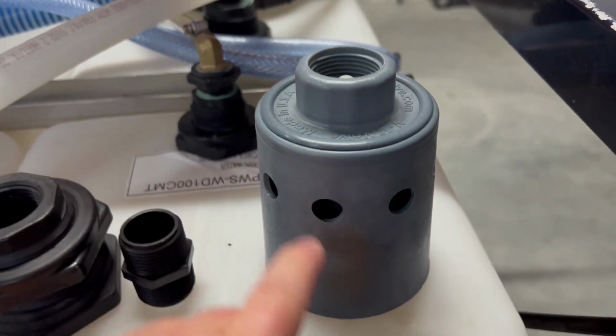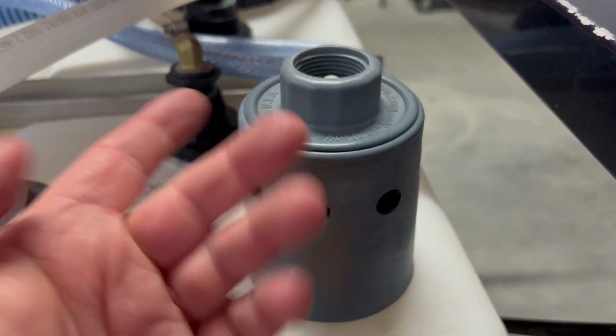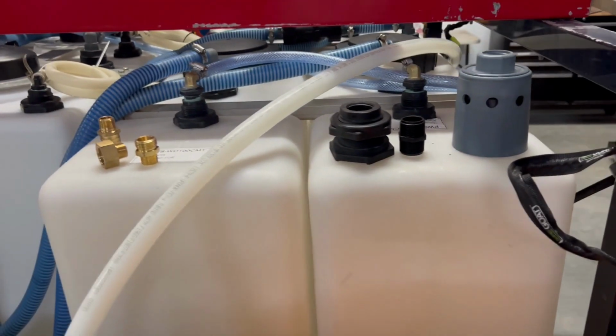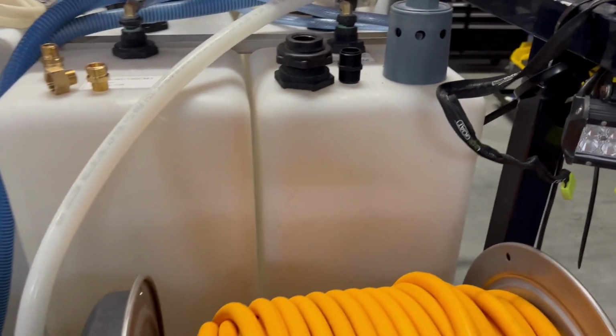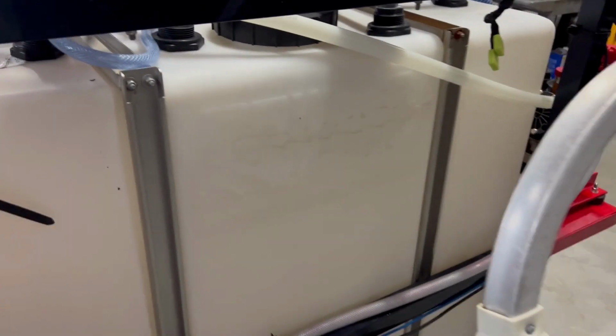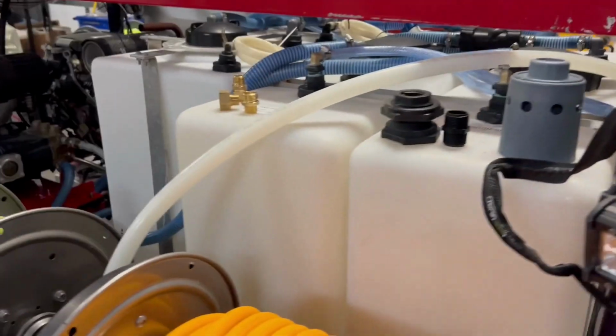And the way the Hudson float valves work is when the water in the tank gets full, it hits this, it closes the valve, and you don't overflow your tanks everywhere. Now, when the water drops, that opens and it fills your tank again, which is the premise of buffer tanks. These buffer tanks are actually slimline Water Dragon buffer tanks, and we plumb 2 of them together. You can see down there, we've daisy chained them together, and that's how we make it work.